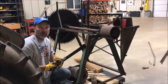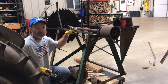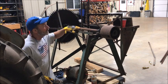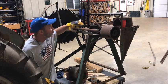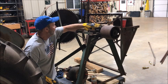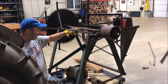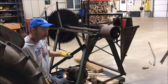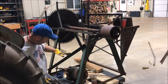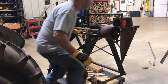I want to take a few minutes to talk about this buzzsaw. Our cordwood saw. This is supposedly a Stober 1940 version. It's got a 6-inch pulley on it. I think this is a 1.5-inch shaft, and these are Babbitt bearings right here. We'll have to put oil in there constantly and keep those lubricated. What I've got to do is take this brace off right here, because right through here is where I'm going to put the 3-point.